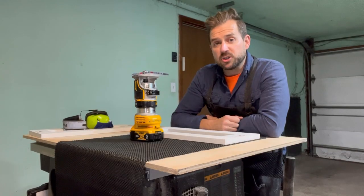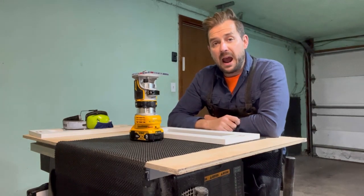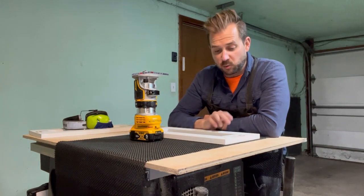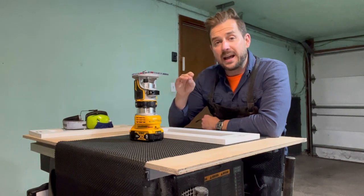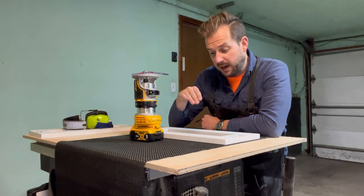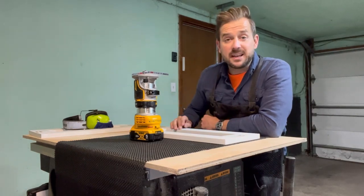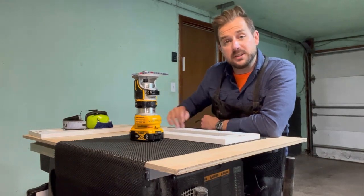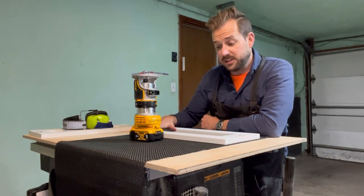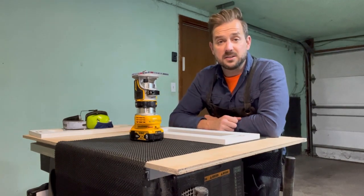These doors are just for show, so I'm going to router a groove on the inside of them — about a half inch deep total. We'll make two passes, quarter inch deep each time, take it nice and slow, then reset and do the final depth. Because it's on the inside corner, we're going to go clockwise — compared to the counterclockwise direction you normally use on the outside with a router. Inside, we go clockwise, two passes, nice and slow.